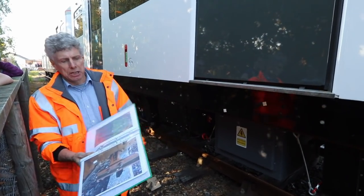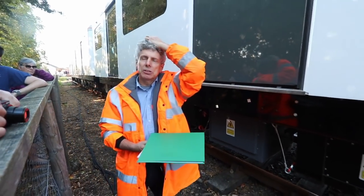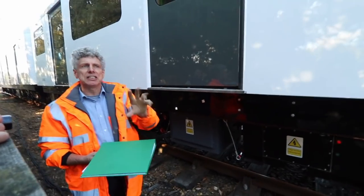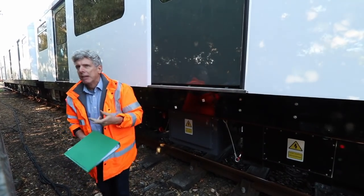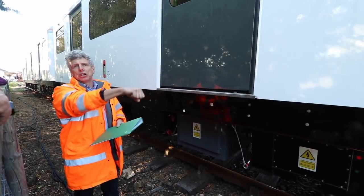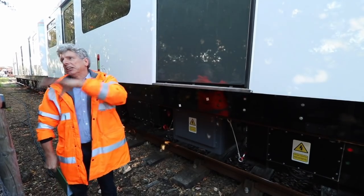So for a hybrid train — a bit like hybrid cars where you've got an engine and a battery — you can lift that out and put a gen set in instead. We're charging the batteries at the moment off my latest Tonka toy, which is a 17-litre Volvo diesel engine driving a half-megawatt alternator that produces three-phase AC — exactly the same as you'd have in an industrial factory. Inside it is the biggest Halfords charger you've ever seen, and that converts AC to DC.